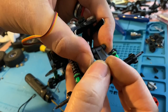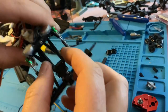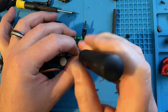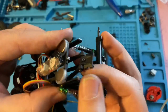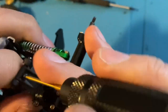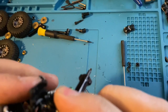I think that looks pretty good. You can see we've got our little hole there and it comes through the back. It shouldn't come out too much, but that should be plenty of meat for a good screw to hold into. We're able to get the screw in there — we are coming out the bottom here just a little. Actually no, that was just plastic. Let's keep screwing it in and see if we're coming out the bottom. Yeah, we're just barely coming through the bottom now — that's all the way tight. We're going to have the limiting strap in there, so just barely a little bit coming out. I'm pretty sure that will not hit.